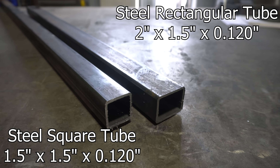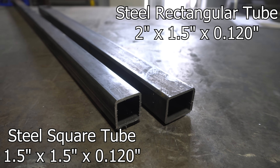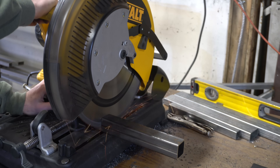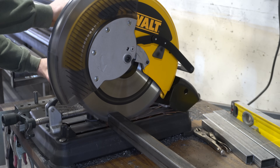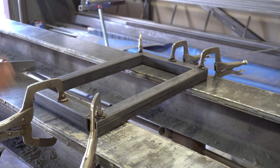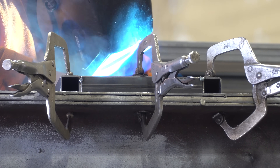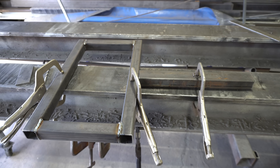The end of this steel tubing will get welded right to the BMX bike, which you will see shortly. So now it's time for me to go buy some steel tubing and then head over to my friend's shop where I can get this thing welded up. I started by cutting two pieces of the inch-and-a-half by inch-and-a-half square tubing to nine inches in length, and then cut two pieces to 20 inches. I then assembled the pieces into a rectangle and got them welded together.